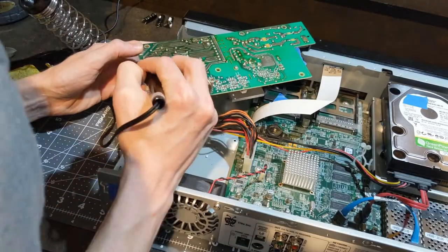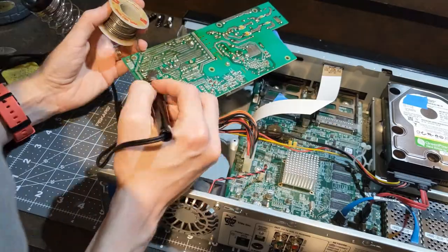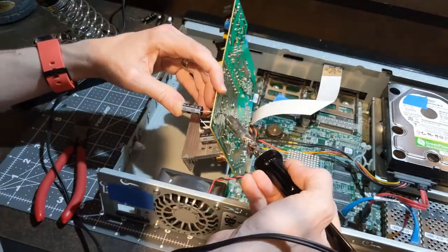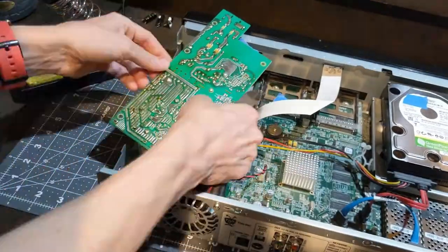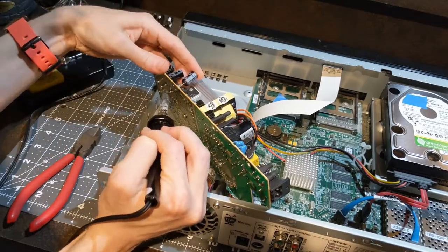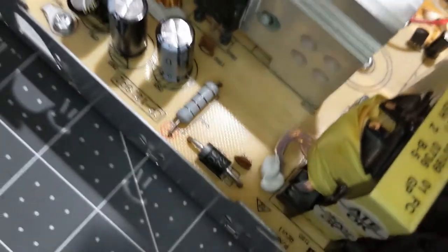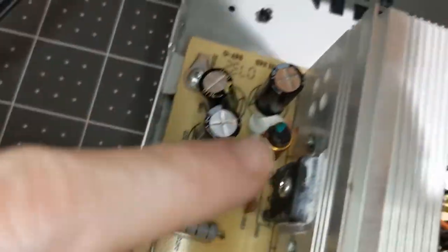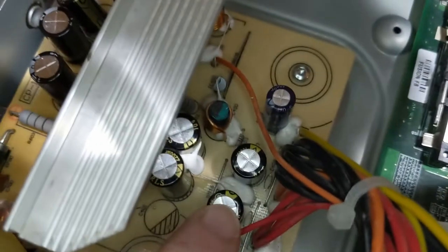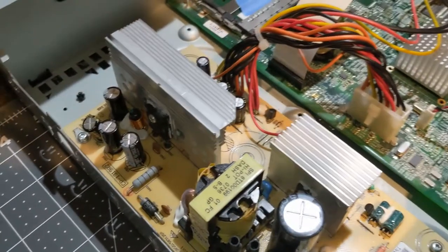Now you're seeing the same process basically in reverse — heating up those same pads because there's a little solder left, poking the capacitors through, and then putting some additional solder on those connections to make sure they really connect to the board well, because a lot of that solder got removed. We're using some of the solder that's there, but mostly heating it up, pushing the capacitors through, and then trimming off those long leads. Here they are all back installed — you can see those three have been replaced. There are little gray tops; all the original ones have these yellow tops, except for one that's blue for some reason.